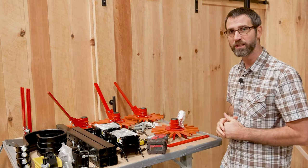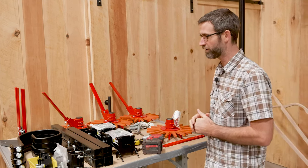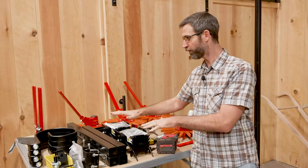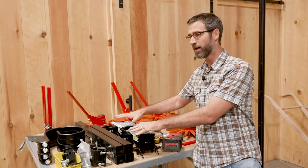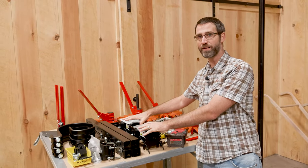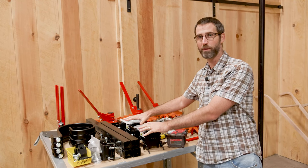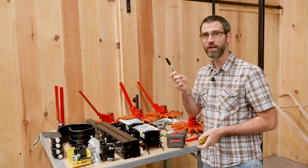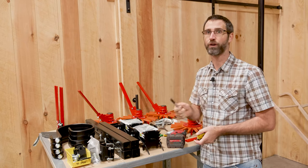That's a quick overview of the different tools and implements that we're going to be putting together. We did a pre-assembly on most of the items. What we're going to start with is first mounting the trailing arm mounts, and we're going to center those on the thirty inch row spacing. We're going to start off with a tape measure and a sharpie to make sure we know where we're going to put things on the toolbar.